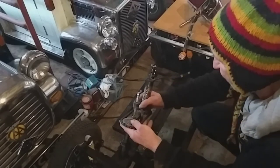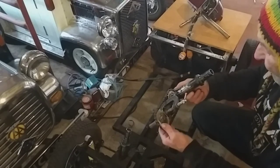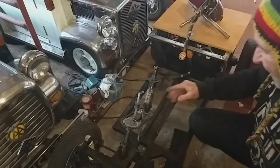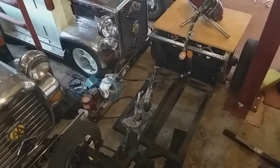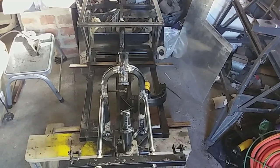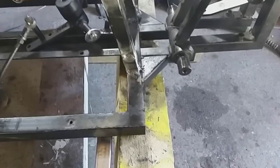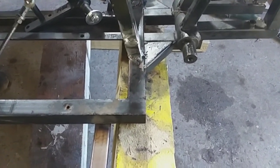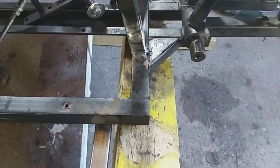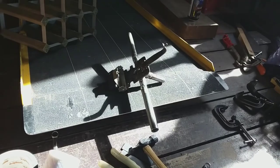Once I get that right where I want it, I'm going to sand some bits off here, get these curved armrest bits, chop them so they go up here and weld on there to hold it all solid, and then put a couple of bars through here with 10mm bolts with a nut each side — so where the welding distorts it and your chain won't be the same tension all the way around, you can alter that by tightening and loosening to get it sorted. I need to shorten this chain and clamp shorter bits of metal on there to hold it and check it, because once you've welded all this up and it's all done, you've got no chance of altering it without a lot of aggravation. It's worth knowing that on some of these Cordobas the suspension on the front seizes up. It's a good idea to take them off and free them up — I had to put thin oil on to get them moving.